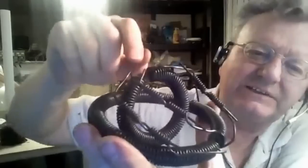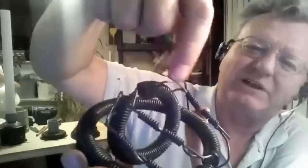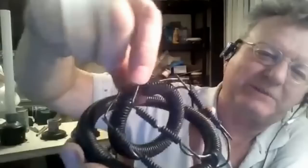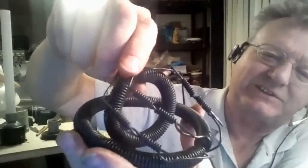Go ahead. Another interesting thing about this design is the wires coming off here come off in a sequence in a row. So you could have a little plate of plastic there with some holes in with the wires coming through, and that would hold your coil ends right where you want them without any wires touching each other. In the other normal way of putting the two together, you've got cross wires, and I'm always in there with hot glue trying to make sure there's a gap between the wires so that they don't short circuit. In this configuration, you can bend them straight up and they're all separated. They're not crossing each other.